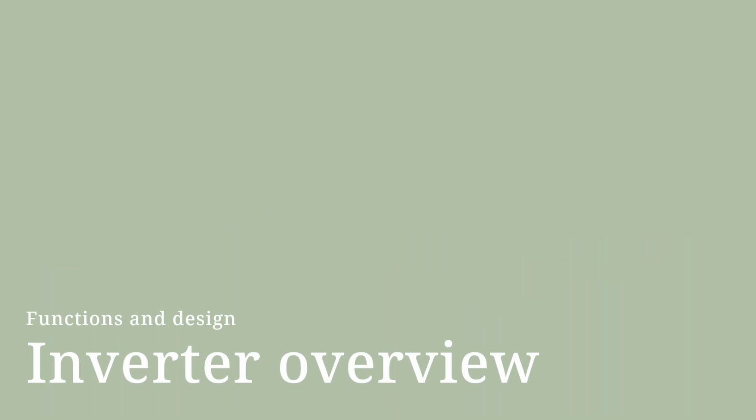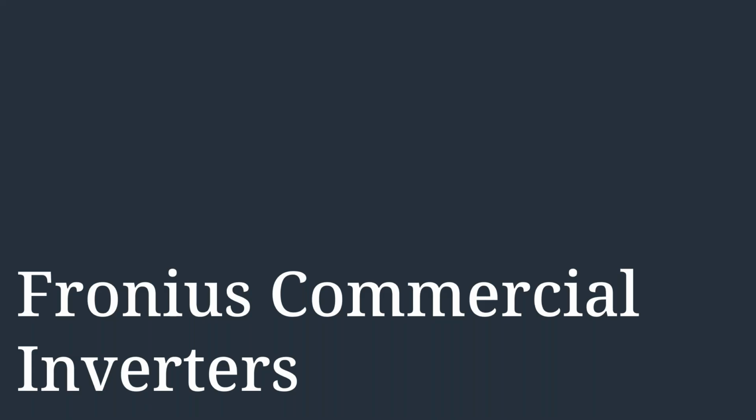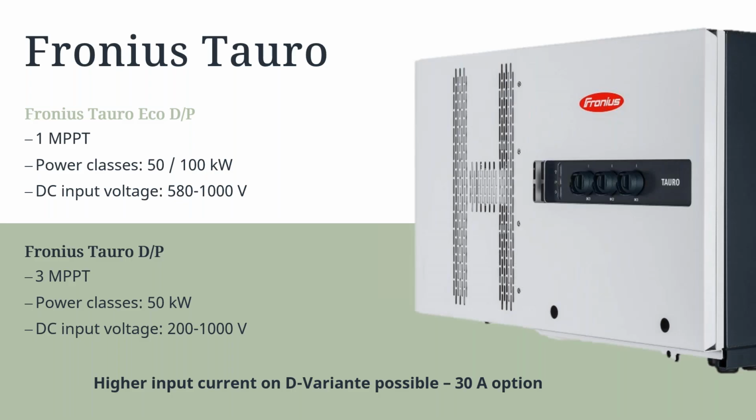So to start off, we'll be covering just a brief inverter overview. From Fronius, we have what we call our commercial inverters. So this will be the Fronius Tauro, which is available as an Eco and Tauro standard. The P and D variant refers to the DC inputs coming into the unit. So you can either be direct MC4 connections or P standing for pre-combined coming in. The Fronius Tauro Eco only has one MPPT input, and it's available in power class 50 kilowatt and 100 kilowatt. The DC input voltage range on the unit is 580 to 1000. This is not the usable range, but the simple input range.